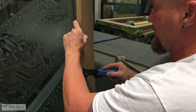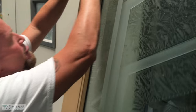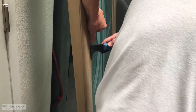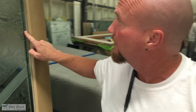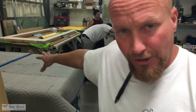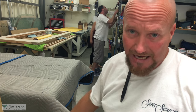The sides come off usually a lot easier than the bottom or top. Now that the molding's been released from the door, you can see a black line going around the perimeter — that's the glazing tape that holds the glass into the door. This glass will not come out with the tape in there, so we're going to lay the door and glass down upside down so we can chisel around the glazing tape to remove the glass.